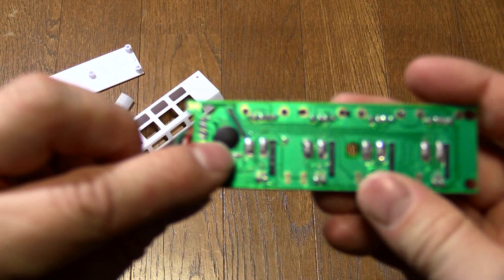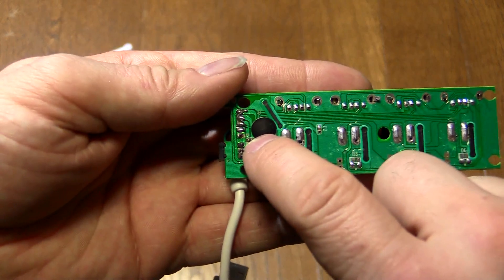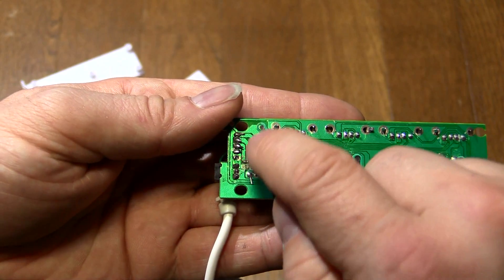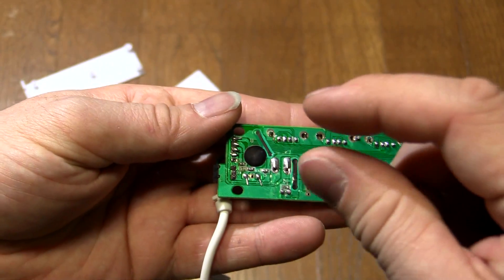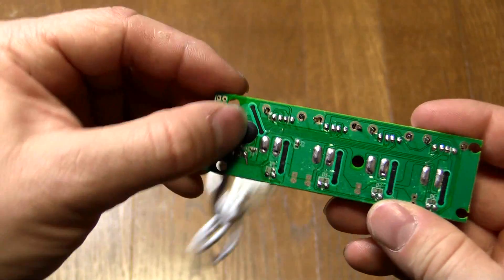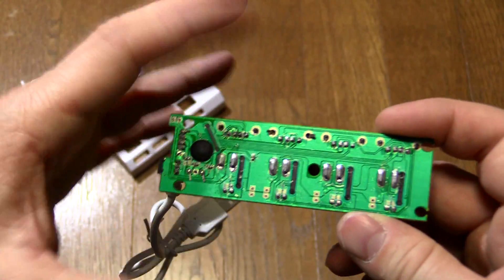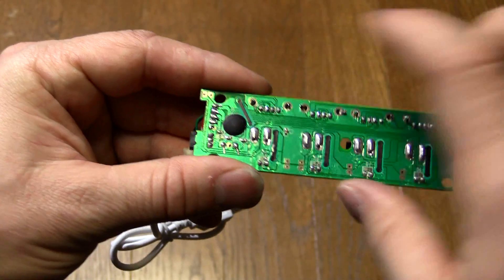We've got a chip-on-board. Rather than spending the extra few cents on soldering a surface mount chip onto the board, they put the die directly on the PCB and then do jumper wires from the silicon to the board, and just drop a blob of epoxy on top. You're saving the money on the metal legs and producing a package. This is very common on cheap electronics — it's not cheaper for small runs of a few thousand, but if you're doing 20,000, 50,000, or 100,000 items, this ends up being cheaper.